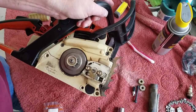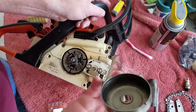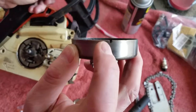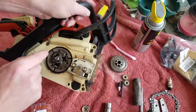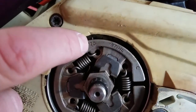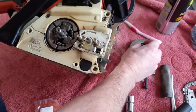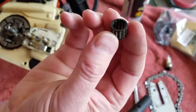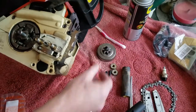To take this apart, you take the clip off, take that washer off, take the outer thing off the clutch. It's got a little indent right there - an index mark. Well, if you look down inside here, you'll see it corresponds with that. That is a worm gear rod that turns the worm gear, which turns the pump. When you take that off, make sure you take your bearing off there and make sure the bearing's in good shape - the cage is okay, make sure none of the bearings are missing.